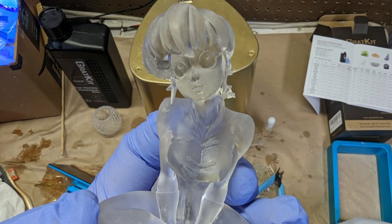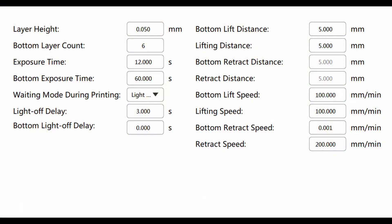There's a little clouding to be expected, but overall the print came out really well — it's still fairly clear and has a lot of detail. These were the settings I used for the practical prints. While I likely could have dialed it in and reduced the cure time below 12 seconds, this is where I had the most consistency with things adhering to the supports.